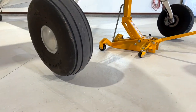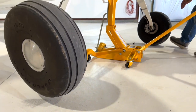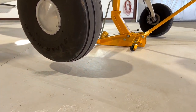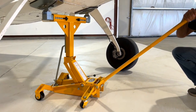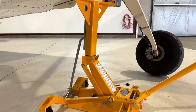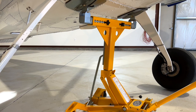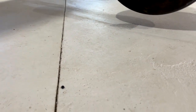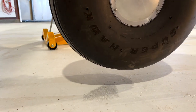You can hear the safety stand click into place. I'm going to go a little higher. Now, with these jacks and all of them, be real careful on releasing pressure. I just released pressure, but not all the way, then I tighten it back up. The jack is supported by the T-stand right now, and if you look at the right gear, we're more than high enough to get that whole tire off the ground. These are 856 tires and require a little bit higher jacking requirement than you would for 606 tires.